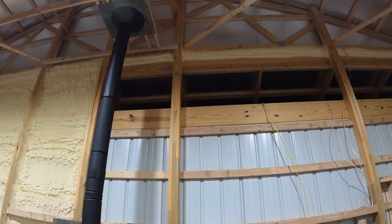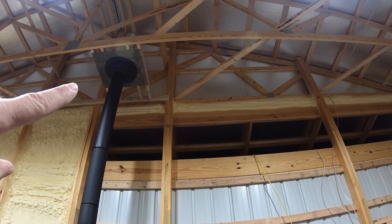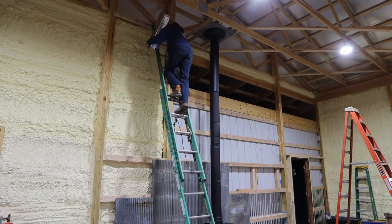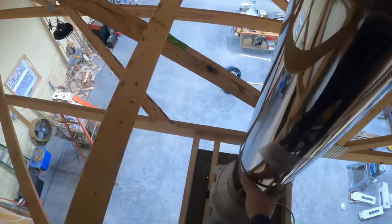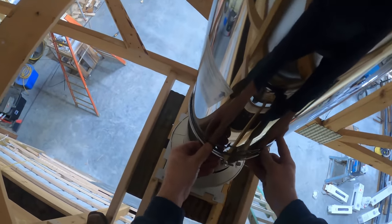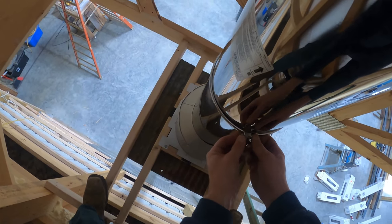is get up here in the attic and do the stainless steel insulated chimney pipe from here all the way through the roof. So our chimney pipe's gonna go on, and then it twists into place. Then we got this locking ring that goes around it and attaches the two pipes together so they can't